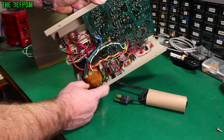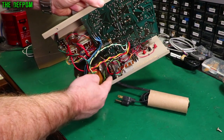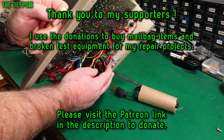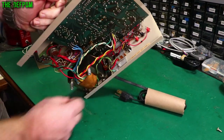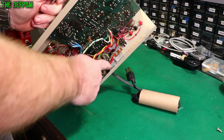There's an earthing lead here. I think this is a shielded transformer but they've got the shield going to neutral. The earth wire is coming over here to a tab, but it's not soldered on — it's just sitting there wrapped around, not soldered. We need to fix that. We're going to replace this cable anyway, but that's a bit of a bodge. It's been like that for how many years?